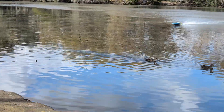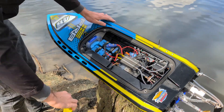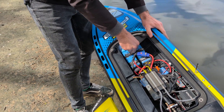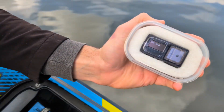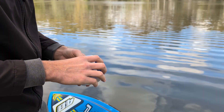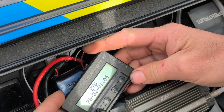This run is on 15 degrees timing. A bird tried to attack me! All right, let's see what speed that did. The GPS might not have had time to lock on yet... 94 km/h. Wow, the trim tab took a lot out of it — it went from 102 down to 94. Anyway, we're just doing a baseline so that's all that matters. Now I'll pull the timing down a little bit.